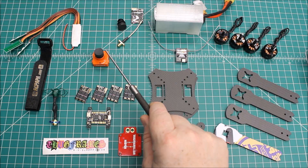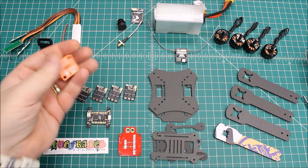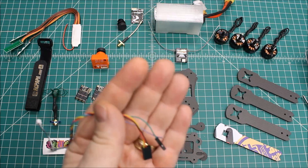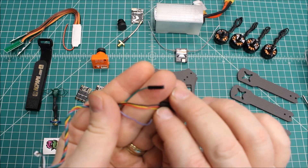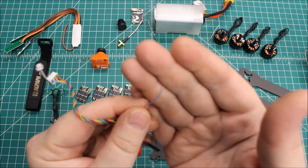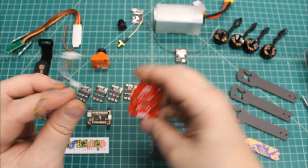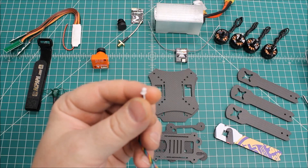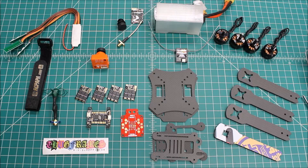For the camera, this is the Aero camera with the 2.5 lens — a really nice, clean camera. The OSD wiring on this thing is so simple: you've got your video signal, power (I'm running 5 volts to the camera), and ground. Then one wire goes to any straight lipo power point — ESCs or elsewhere — and that's where the OSD system gets its voltage information. When you want to program it, you just plug this connector in and you can adjust OSD settings, add your name, or change camera settings.